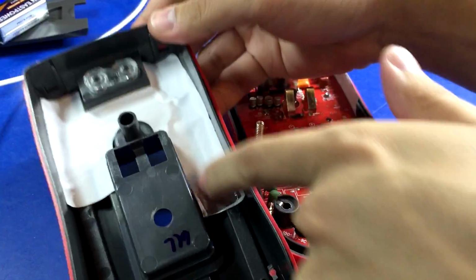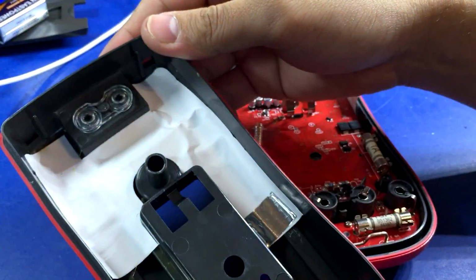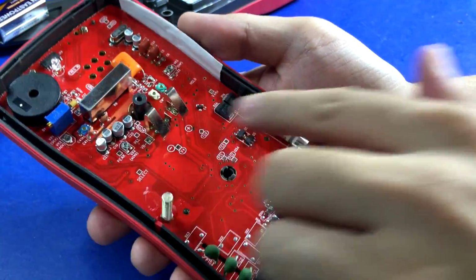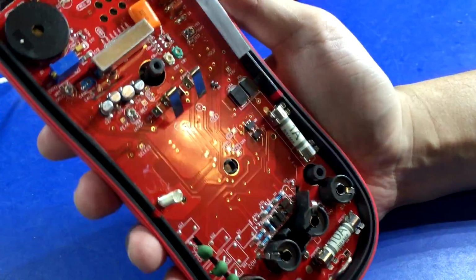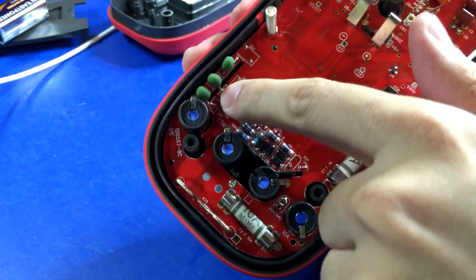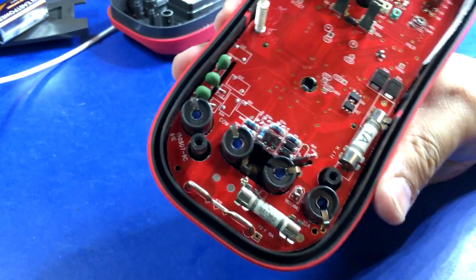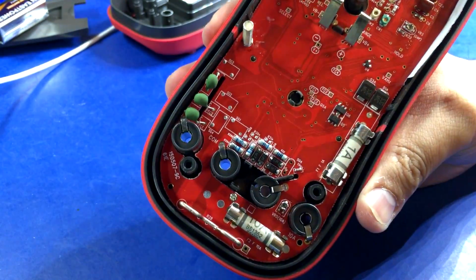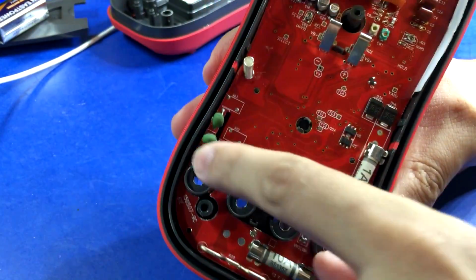Okay, so it looks like there's some shielding, some light pipes for the IR send and receive. And then there's the battery terminals on the main board, which is nice. And hey, looks like they've upped their quality a little bit. There's actually an isolation slot there, which you used to not see in the old models. I don't remember that being there anyways from seeing other people's teardowns.